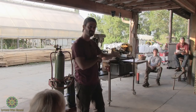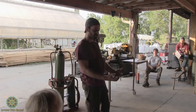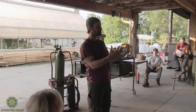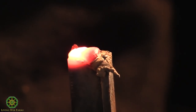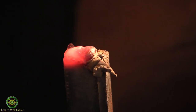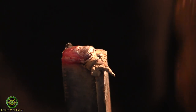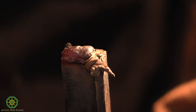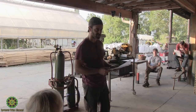Welding is actually a fusion of the metal. Say we're gonna make things stick. What we actually do is, if you think of two separate pieces of metal being melted at the point of the weld, they're being melted together, and we're adding metal to help that happen. We're superheating this very local spot, and we're adding metal. It gets extremely hot right there at the arc, and that is opposed to things like soldering.